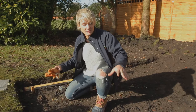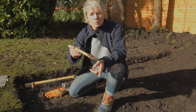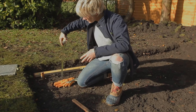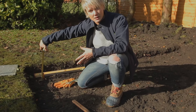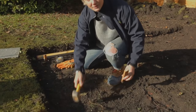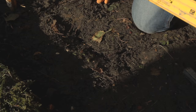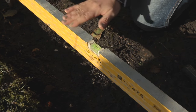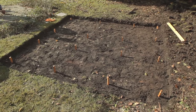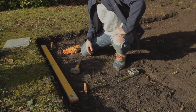This is the important part — this is where we get it level. Cut yourself a couple of small pieces of wood, the same ones we used for the corners, and drive them into the base layer. We've gone for about 80mm depth. Get yourself a lump hammer, drive the peg in anywhere in the base, and find your level. Repeat this around the base — when you drop your scalping in, just bring it up to the level of all your pegs for a nice level base.